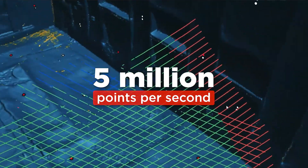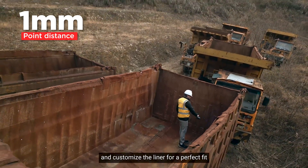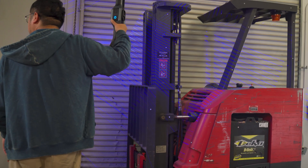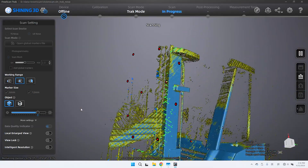How quickly? Five million points per second. What kind of resolution? For the UE Nova and objects of this size, we don't really need to go high resolution. The highest we can actually go is going to be one millimeter point distance. We've had some guys buy the metrology-grade scanners and scan a whole Jeep at 0.04-millimeter resolution — you don't need that. What are you going to do with that resolution on a big smooth hood?